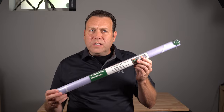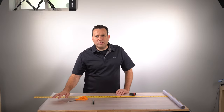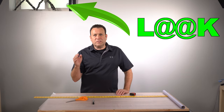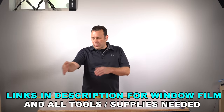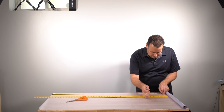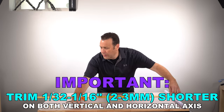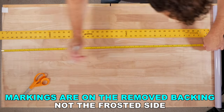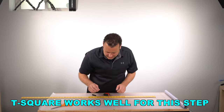Now that we've got our measurements, let's go ahead and cut our frosted tint to fit and then we'll install it. Let's mark our measurements on the frosting. Don't assume that the factory cut edge is 100% square — mine was actually a little bit off by about a sixteenth of an inch on one side, so I just recut that so I have a nice square edge on the one corner. So 42 and a quarter, and then I usually do a 32nd. So 20 and 3 eighths and we'll go from this edge right here.